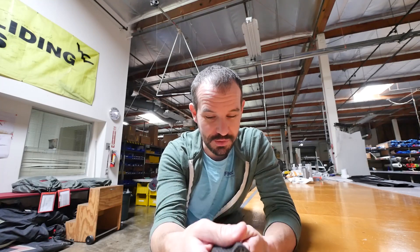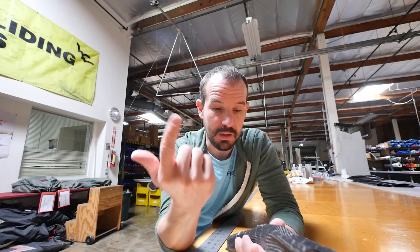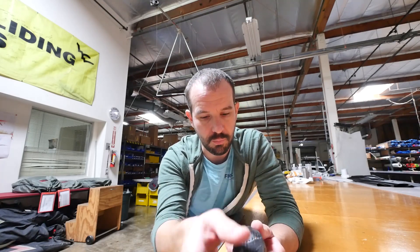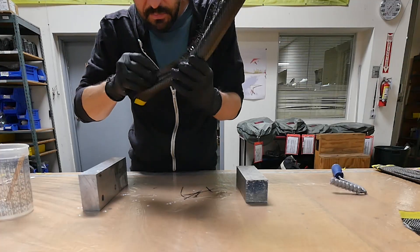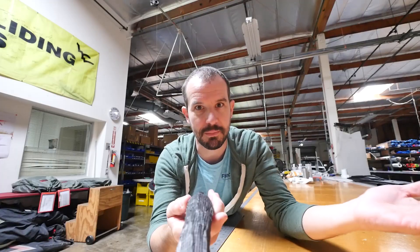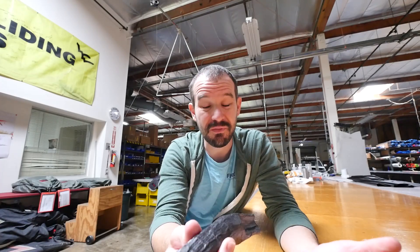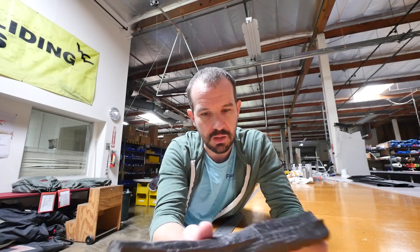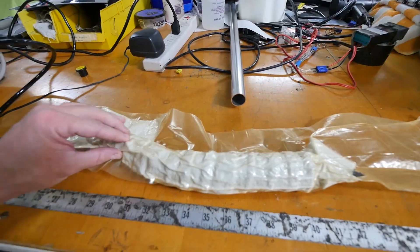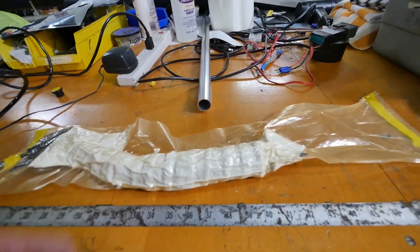Number one: you need good rigid tooling, at least rigid enough to withstand whatever you're using for compaction — this mandrel was not rigid enough. Number two: forget about trying to wrap flat carbon cloth around such a small radius of curvature — the edge just doesn't want to stick, and without the braided sleeves the thing would have been an even bigger mess. Number three: you can't really vacuum bag a part like this either — despite the crushed mandrel, you can see how the bag sucks the material away at the edges. Maybe if the bag was closer to the same size as the part rather than oversized you'd get less crimping. And the last lesson: don't wear a black shirt when making videos about carbon fiber parts — a brightly colored shirt would give much better contrast.